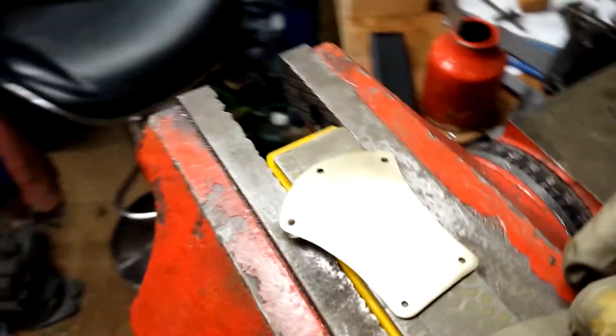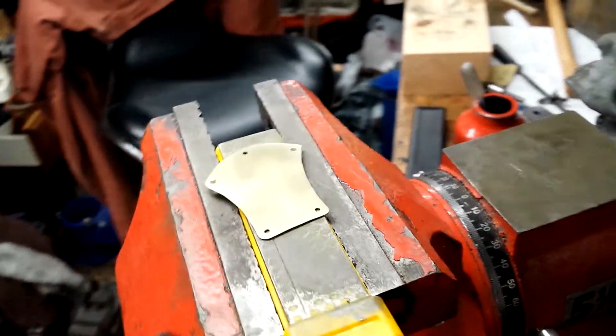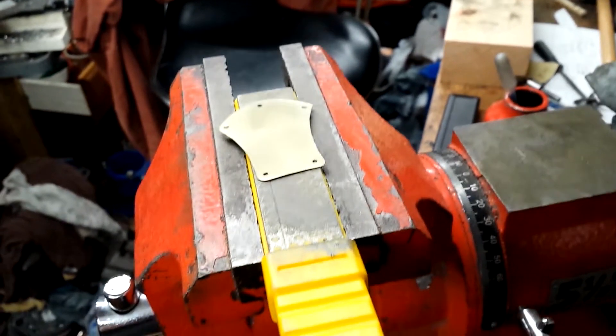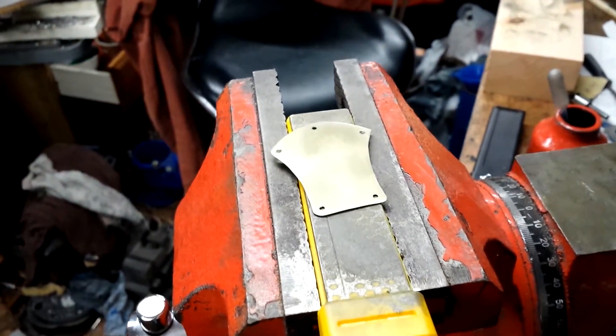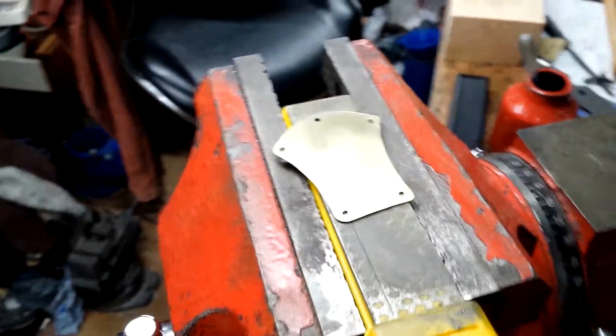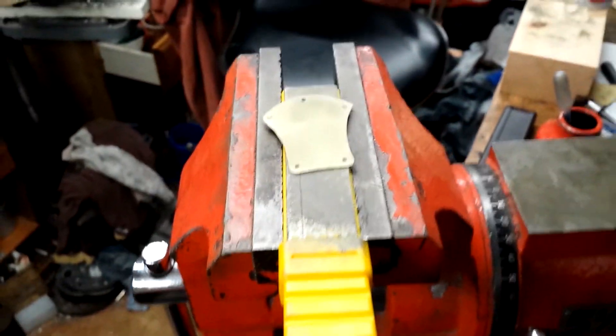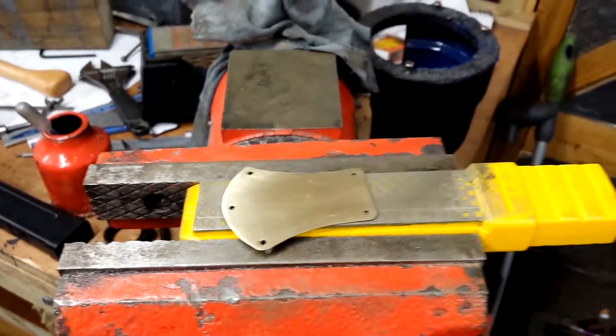I've had to resort to fine-grit sandpaper to get some of the scratches out, and I've still got some work to do with that. The trouble with sandpaper is it's not going to create a uniformly flat surface. So after the sandpaper I'm going to go back to the diamond lap — rough side then smooth side — to try and get it down to some degree of flatness. I could have persevered with the lap, but there are some jobs that just take too long. You know you're going to be there all night and something different needs to be happening to get a result in any reasonable timeframe.